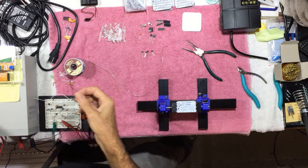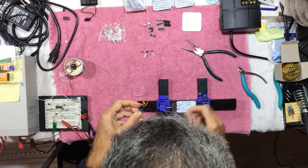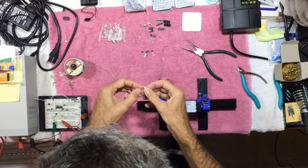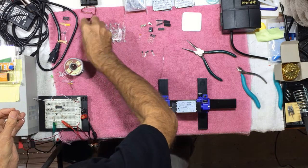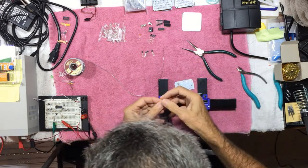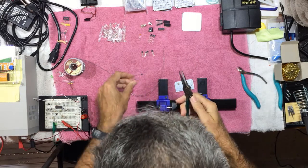But when I built the first one, I felt like the LEDs were a little bit too dim. These 100 ohm resistors that I installed are part of the current limiting for the LED array. So I wound up just making the red side and the green side the same values. I am going to put two 100 ohm resistors, installed in parallel to help with the current limiting a bit. I'm just going to install them side by side in the hole that's labeled 560. You might want to check the brightness and see what you think, and that's the way you would change the brightness.